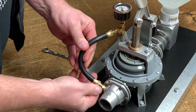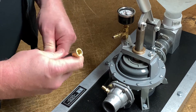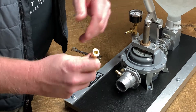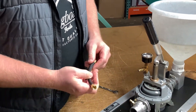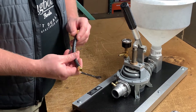They're swiveled so they're real easy to take off. For cleaning, use water — wash it out in warm water, regular hose water, tap water, whatever. Maybe a pipe cleaner or even air. You want to make sure that this line is completely cleaned out. If not, and grout sits up in there, it won't read right or work right and you'll have to replace the line.